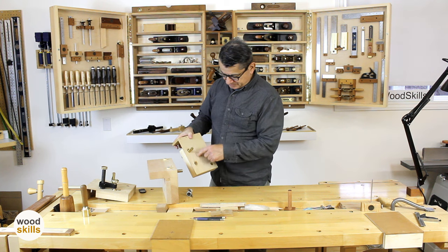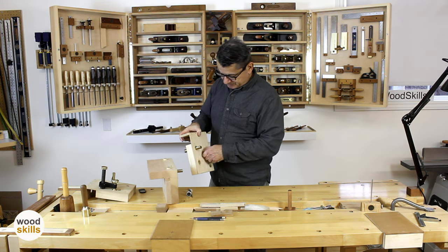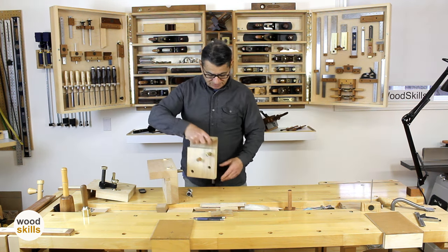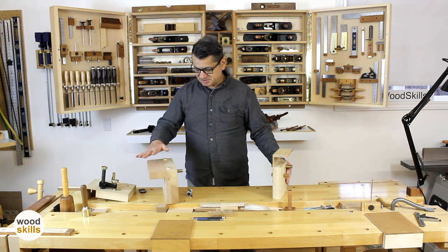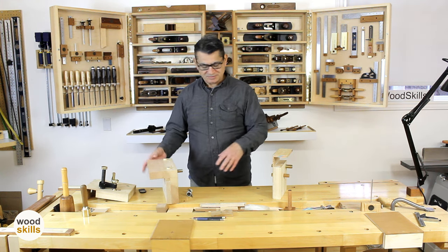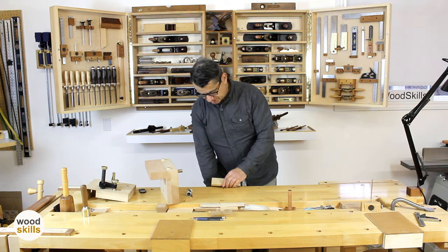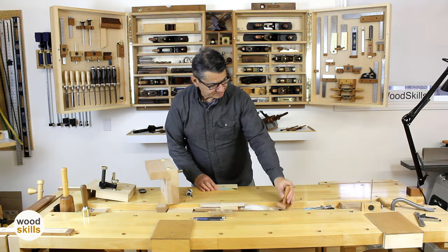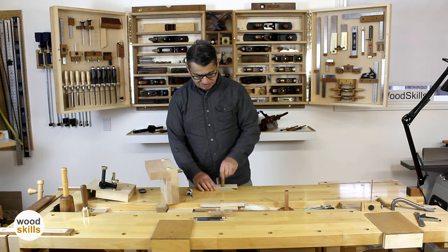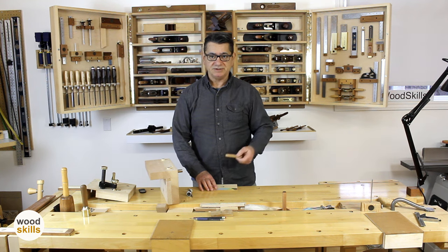You can see the format is the same, with the arbitrary hole spacing and the standard three-quarter inch bench dogs — there's a brass one and a wood one. This actually holds the wood up as you're edge jointing a board, with one end in the face vise and the other at this end. The issue with the original is it's fixed in place; you'd have to unbolt it to move it. But this new one slides across and plugs in — lighter, but performs just as well. It uses any standard bench dog or something customized with a head on it that locks in.